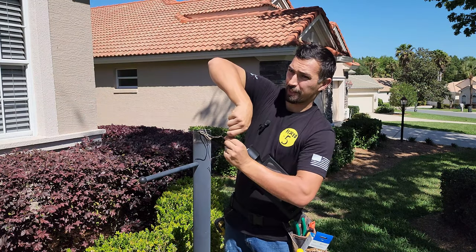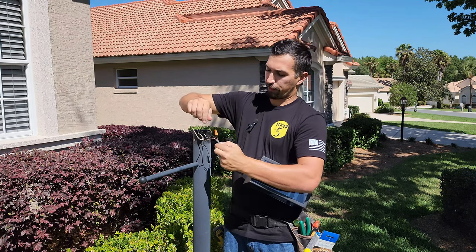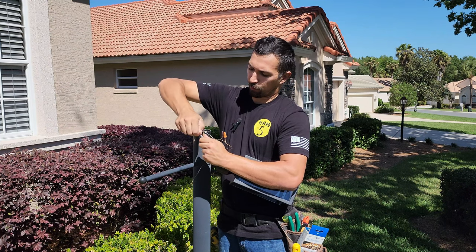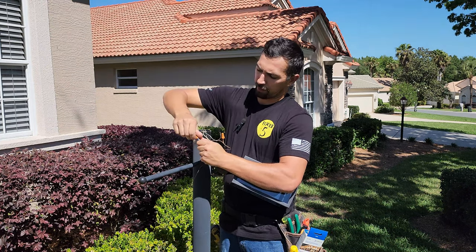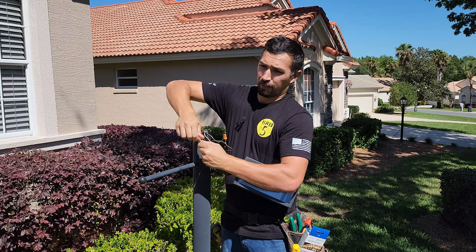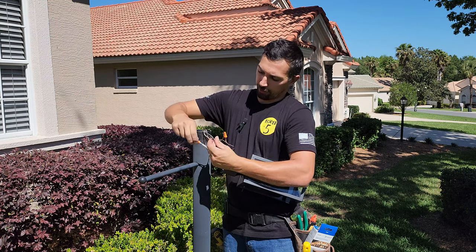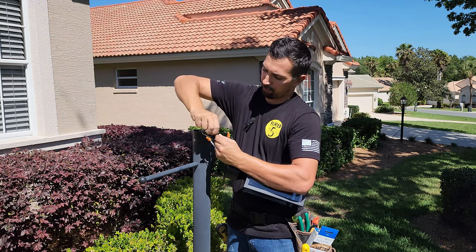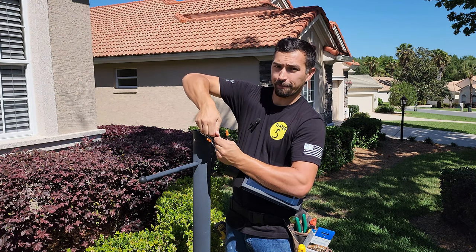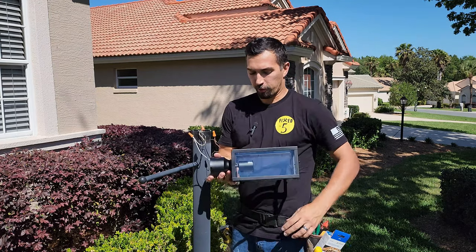What I like to do is reverse it. I'm going to attach my ground first, then attach my white next. As I do that, I'm going to twist it in a clockwise motion to the right, and then go ahead and put the wire nut on. I like to tighten it down enough where I know I can't tighten it anymore and therefore it's secure. Same thing with the black — just enough to know that you finally feel that resistance of trying to twist it in the wire and you know that's in there strong enough.